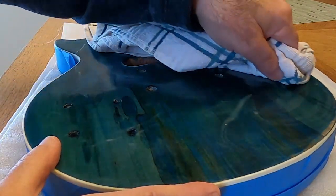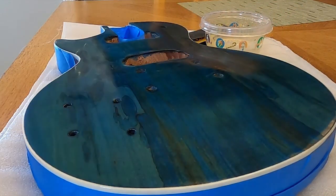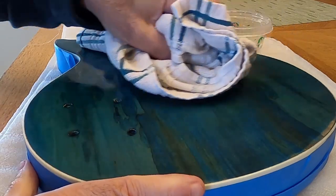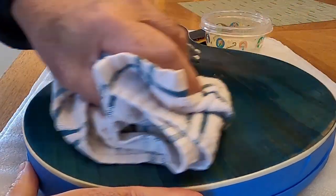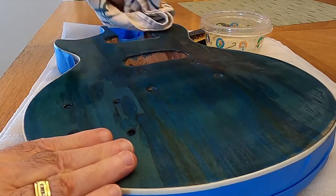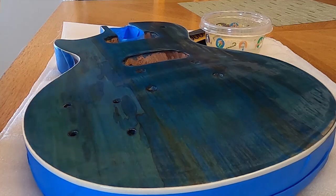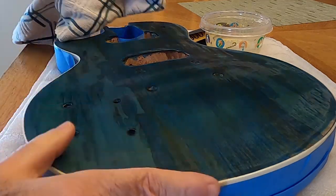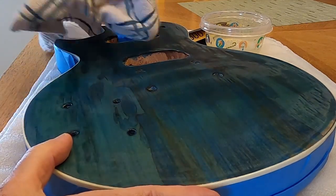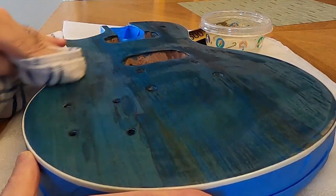And like the boat, what we're trying to do is to get all of these surfaces flat. And still, they're still shiny on there. But here's the thing. You don't want to just take it all the way down, because then you're going to be right back where you were. You probably have all the varnish taken off. You want to slowly build that up.